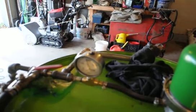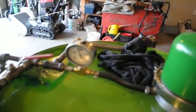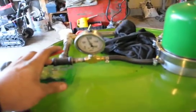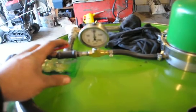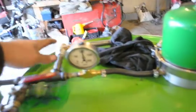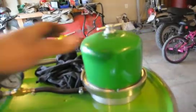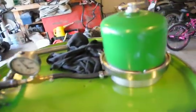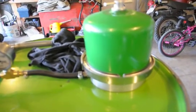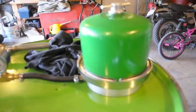I've already washed this stuff for about 18 to 24 hours and we've pulled out a bunch of crap, a bunch of goo. This will pull out down to half a micron. It's spinning good. When it's thick like this you can get a lot more PSI than what you need, and you might have seen the bypass valve kick out right at about 100-101 psi. I'd go 24 hours — that's what I do. It mixes it up real good and pulls out a lot of the garbage. A lot of guys online will tell you to go until it won't pull anything out at all, but I'm telling you this thing will keep pulling stuff out for days and days.